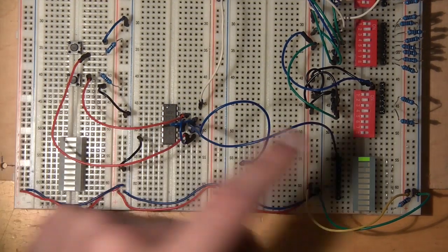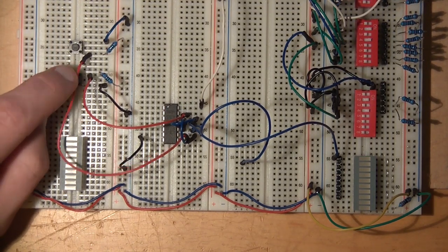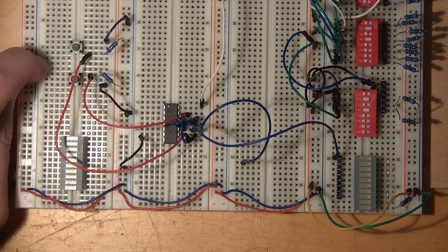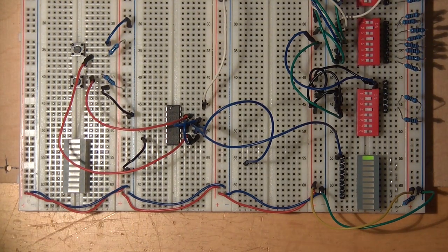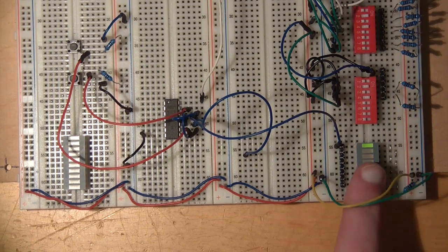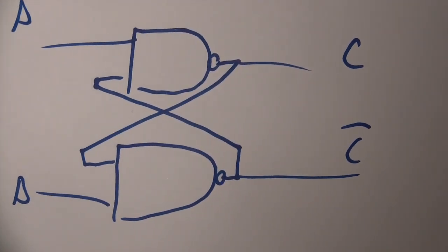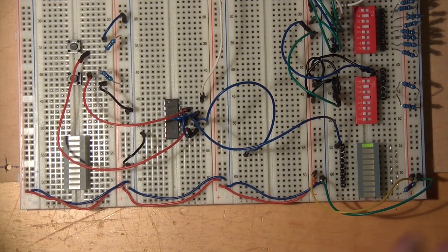At the moment our output is 1. Now it's 0. Now it's 1. Now it's 0. This button down here sets our output to 1 and this resets it to 0. Did you notice something really cool? I have to press once and then I can just go away and wait — as long as I want. As long as there is power in the circuit it will always be 1. In other words, this just stored one bit of information. This really simple circuit is able to store one bit of information. But how and why in the hell does this actually work?